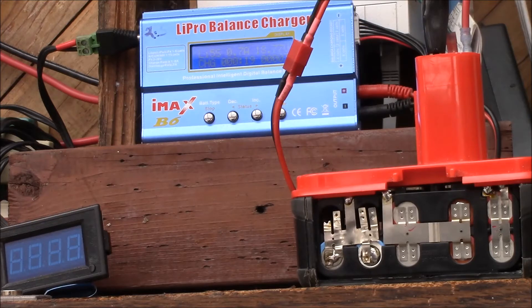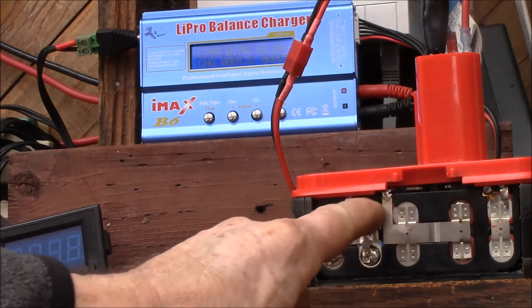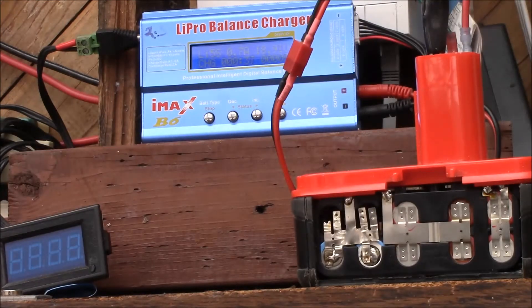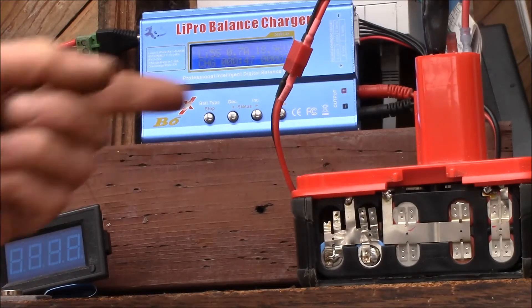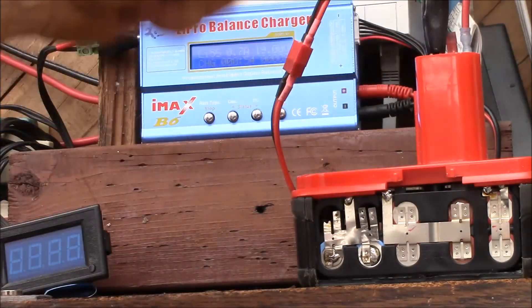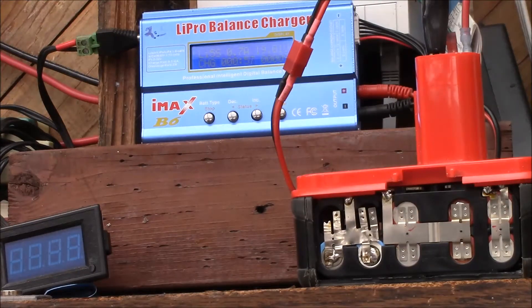This battery was in pretty bad condition. You can see how the voltage is climbing — it seems like it has tricked the battery protection circuit and the battery protection IC into taking a charge. Looking towards the battery from the fuel gauge, that's the left side terminal. I'll let this run — that's the first charge on this recovered battery pack.